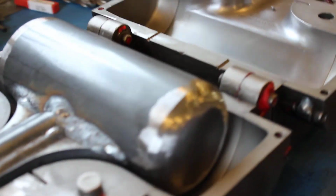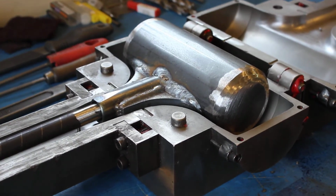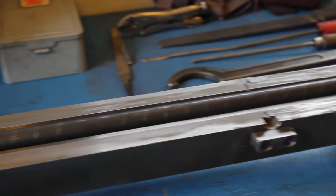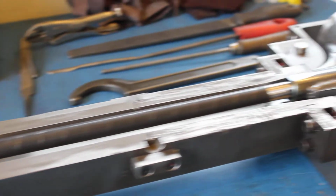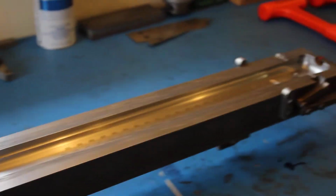And the one thing we do that nobody else in the industry does is we sandblast all these internals and hand coat them with Chemlok. The bonding process allows the urethane to bond to the steel much better than the urethane could bond to bare steel. Now I'm just going to make my way over to our bench here, and I'll show you a few of the parts we have.